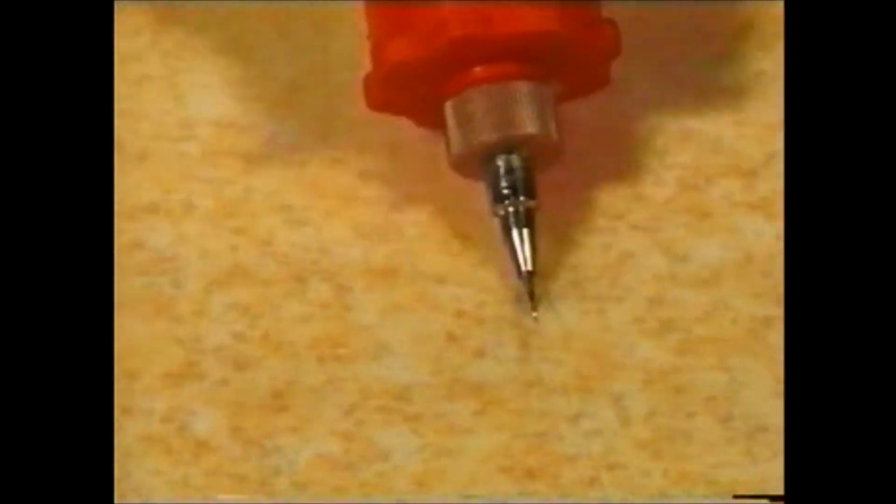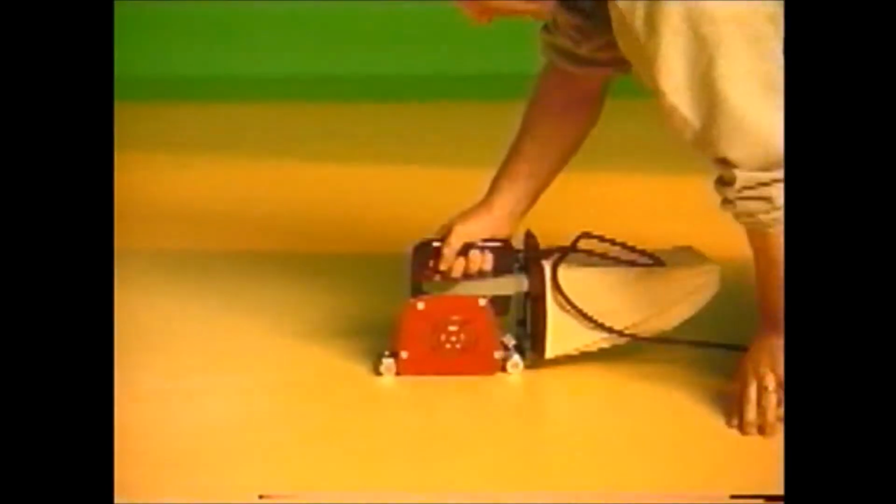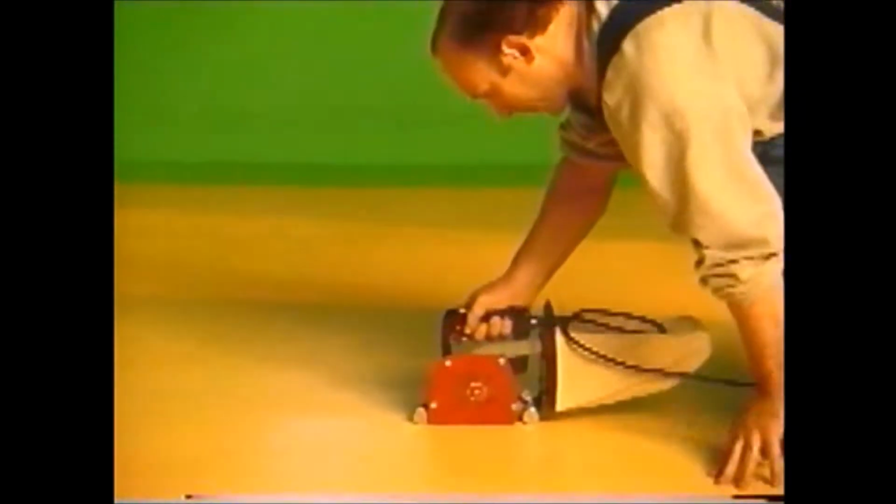In this case, use a special cold treatment product with a nozzle designed to inject a bead of sealant slightly thicker than the flooring so that it rises just above the surface. Then, leave alone to dry for a few hours in a dust-free environment.